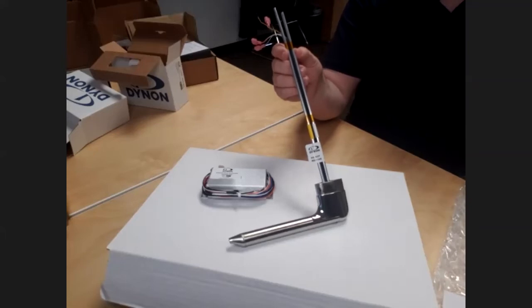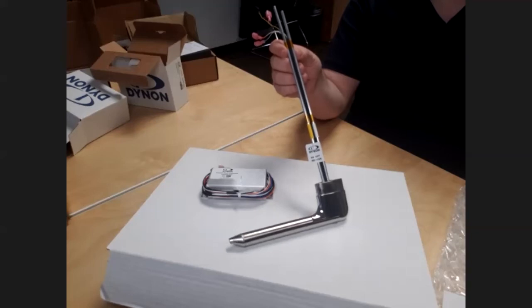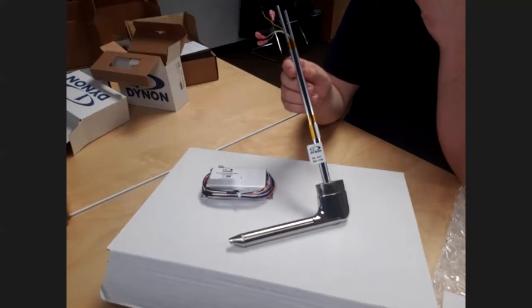And so when you have it nicely calibrated, what you end up with is, as your angle of attack gets really high around the start of the flare, you start hearing those beeps, and by the time you're nicely in your landing configuration, you should have the high frequency tones or the solid tone.